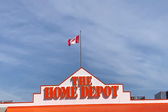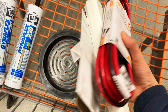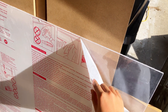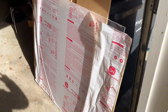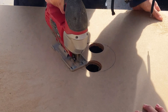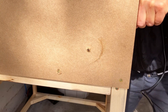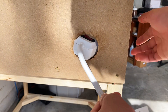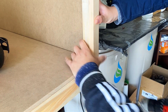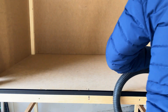Now it's time for another trip to my favorite hardware store, Home Depot, to get a few other important items, like some adhesive silicone glue for the edges of my fume hood, some extension cords for all of the electronic devices, as well as the fan adapter that I mentioned earlier. I was also lucky to have gotten this huge 42 by 48 inch thick acrylic board as my sash, thanks to one of my friends, and I waited till the end to install it. After drilling two small holes on the top board with the help of a hole saw, the 6 inch diameter hole was then cut out with a jigsaw. On the left side of the fume hood, I drilled a small hole to fit in all of my power supply. After vacuuming the inside, I can proceed to the next part.